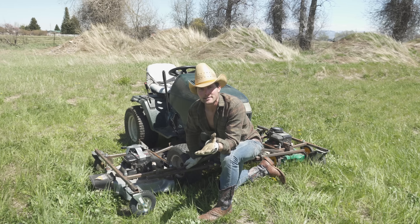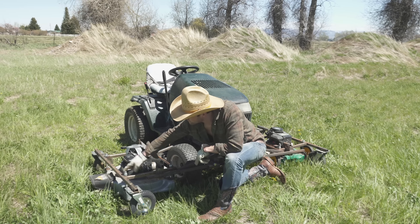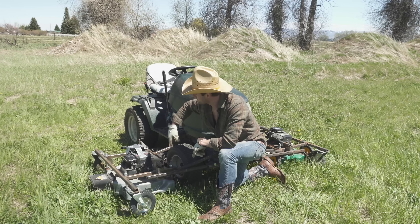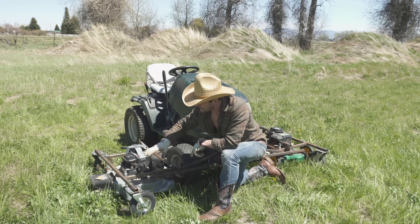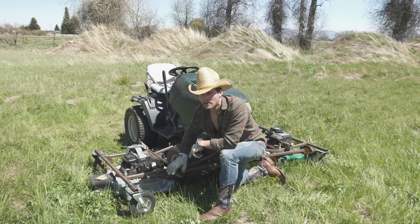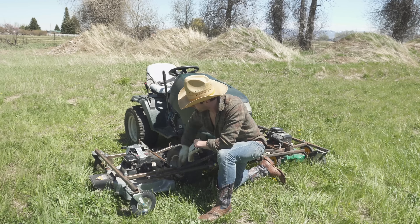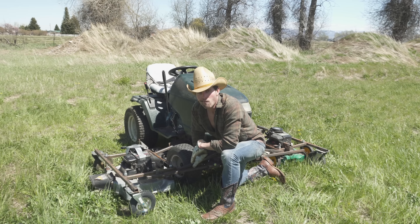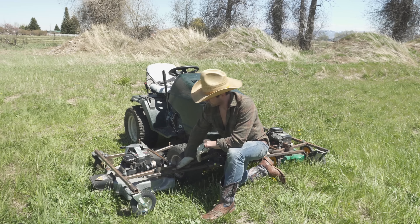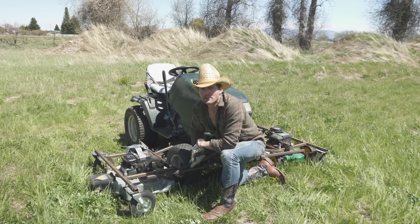Now, you're thinking how the hell do you adjust the height. That's easy. I took the thread off and I welded it on the four corners. And then these here bolts, you can screw them up and down, and that'll get your height just perfect so you can match the height of the main deck. I got some casters from Harbor Freight — seems to work good. Other than that, folks, that's my 86-inch wide deck. Let me show you how she runs.